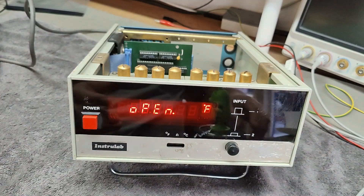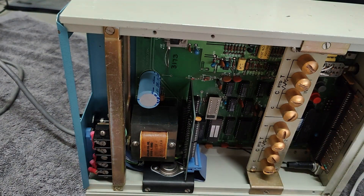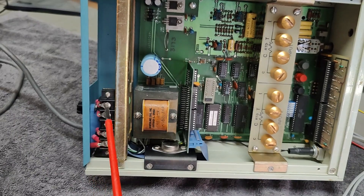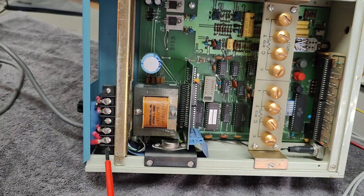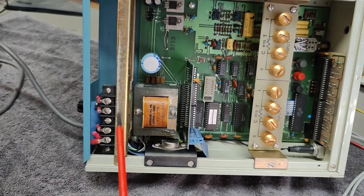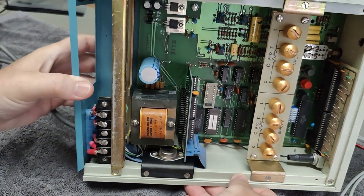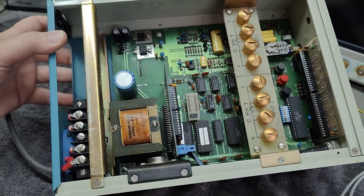Let me show you. Better turn off mains. It's stupid to touch anything there. Maybe this is mains voltage selection. So what I should do — because I've got a variable supply — I should probably figure out how to rewire this for 230. But first I want to play with this. I can definitely continue my little project. I need to pull this out somehow and see if I can access the switch at the bottom.